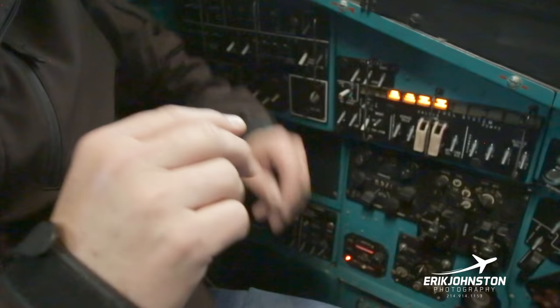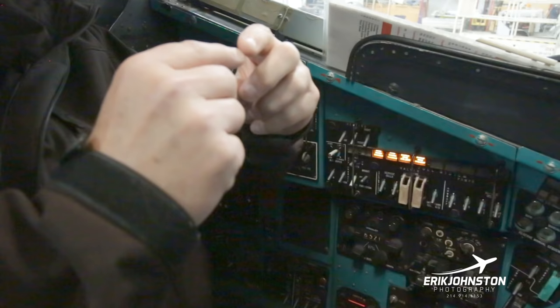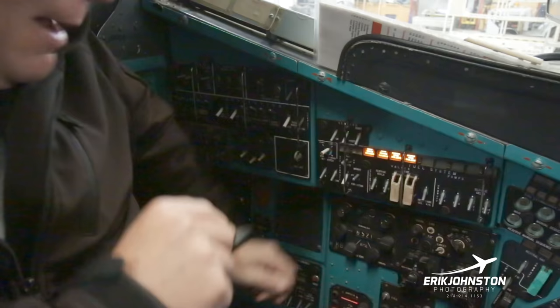We've had problems with a couple of them where the little motor was running them just a little bit over to where it was just like a second and a half. Whenever it ended, it was a second and a half into the start of the next cycle, and it wouldn't start because everything was a second and a half off. So you have to stop it, reset it back to the beginning, and let it go through the full cycle so that we can get a good APU start.